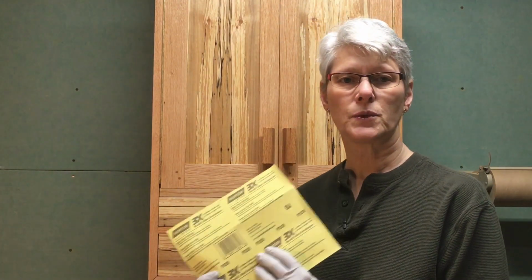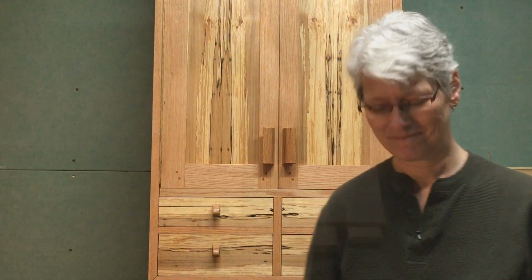I wanted to add an extra word about sanding down to 320 and then down to 600 grit. Some of the books that I've read and sources online say that 220 is normally as far as any woodworker would want to go or need to go for their purposes, but because this is some fine furniture that we're working on, and because it's a Greene and Greene style, the finish that we're trying to achieve requires a greater degree of sanding everything down to a polished surface. So that's why we're going all the way to 600.